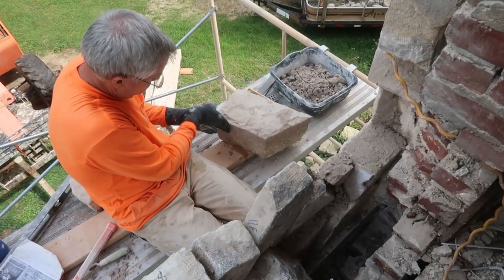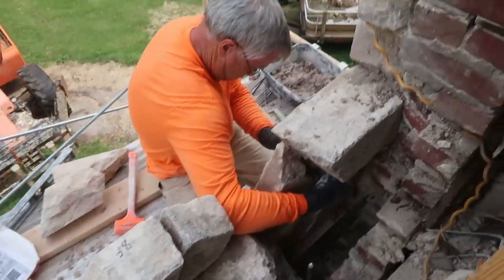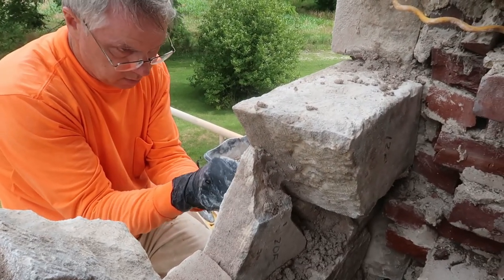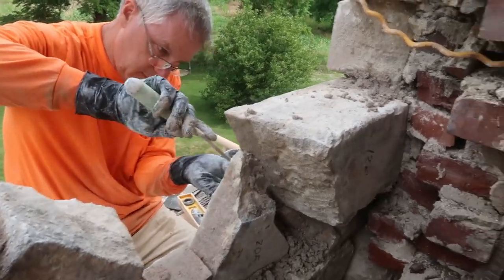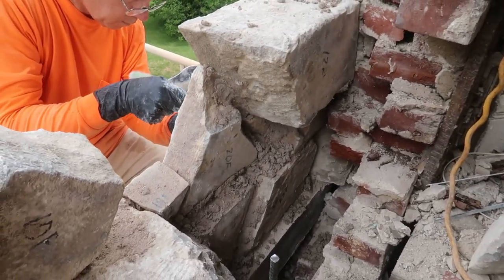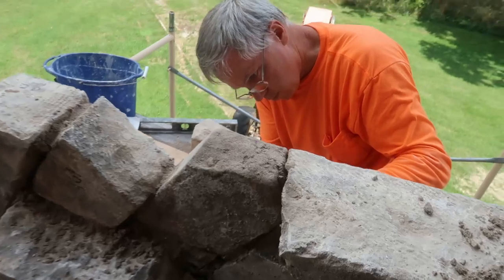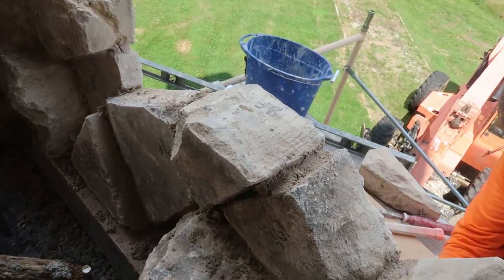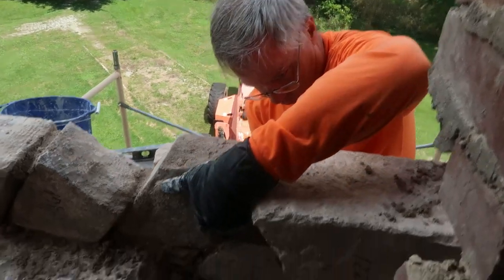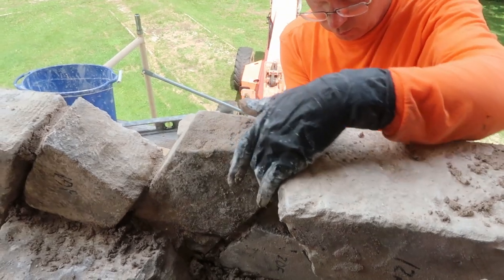No cracks. That great big one is getting ready to go in, right over there. This is a very delicate operation — trying to get all these stones in at the same time. You've got a great big one sitting on very narrow triangles. Very delicate operation. Only two more pieces to go, and then this stone underneath the window is back together again. There's a lot of work trying to get these stones to go back in the right position, level and plumb.